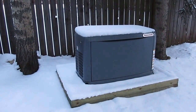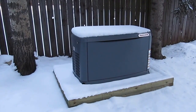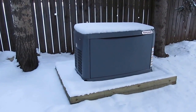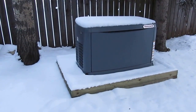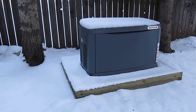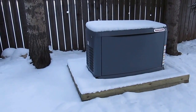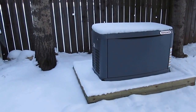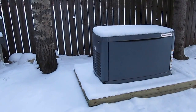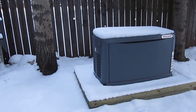It's Honeywell, made by Generac. It's got a 992cc V-twin in it, about 35 horsepower. It doesn't come with a cold weather kit. Generac sells a cold weather kit which is a battery pad for under the battery and a slip-on heater for over the oil filter, and Generac wants over $300 for it.